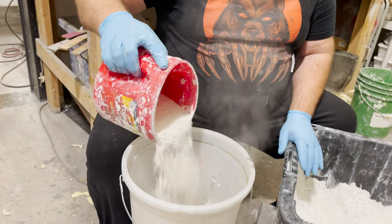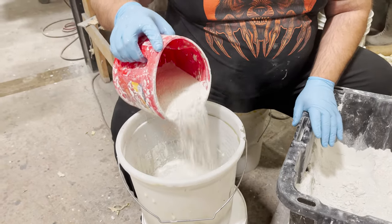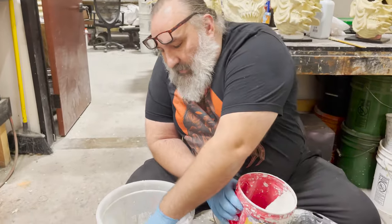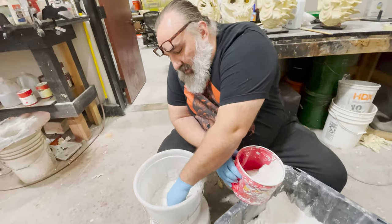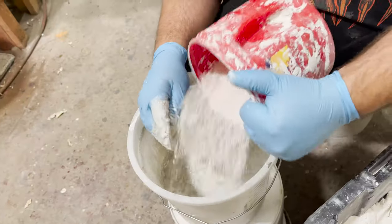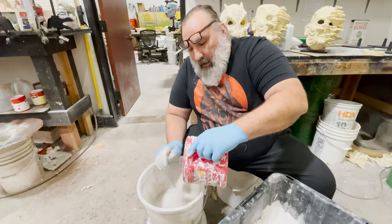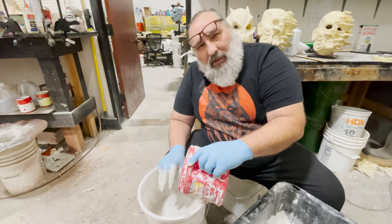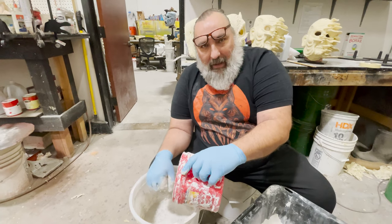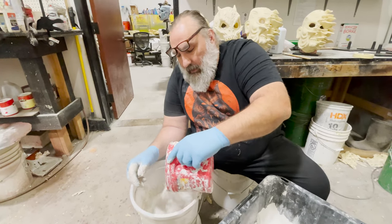This is Ultra Cal 30. I'm not dumping it into the water — I'm letting it sift into the water, letting it build up where it sinks very slowly, and it's going to sink slower anyway because the water is thicker since we added the glue. The island method is not as clean and clear as it normally is because we have thicker water than usual. The bonder fortifier — either Acryl 60 or Elmer's glue — is going to slow down the absorption. It's kind of a plasticizer. It's going to fill some of the capillaries in the plaster. You don't want to make a mold out of this — it won't wick latex the same way — but you can patch a mold with it.